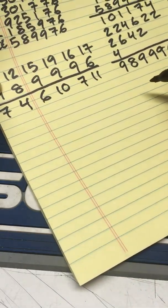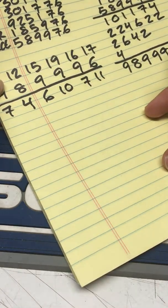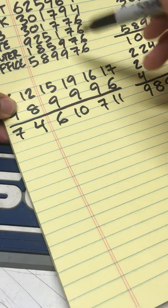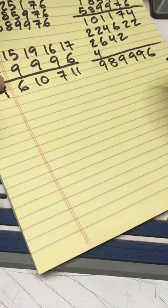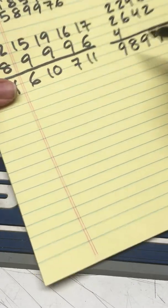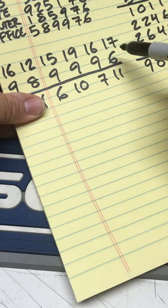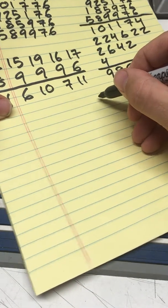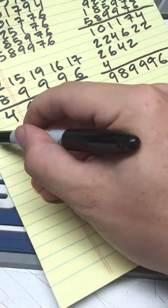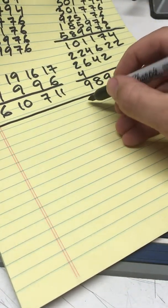So what we need to do now, because in the stack up for your pinning, every bank needs to add up to 23. So what we're gonna do is we're gonna subtract our control key plus 10 from 23. So we'll add that right here. Let's do a line right here to do a fresh start.